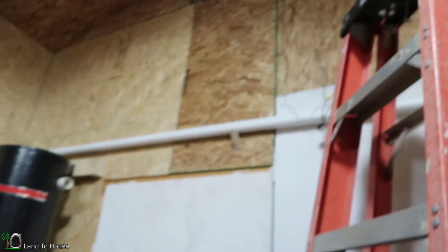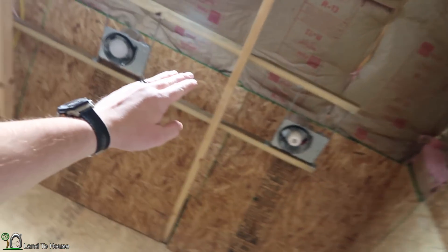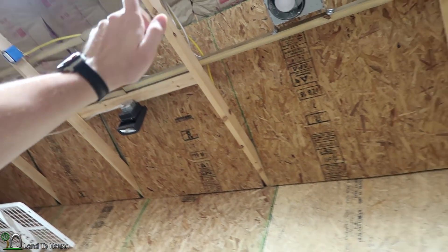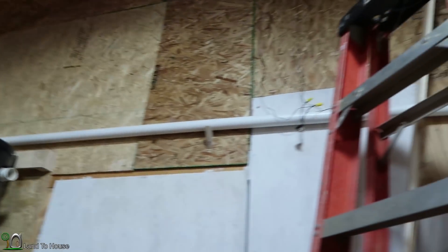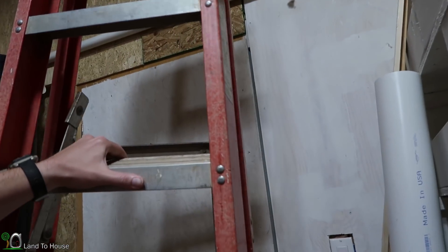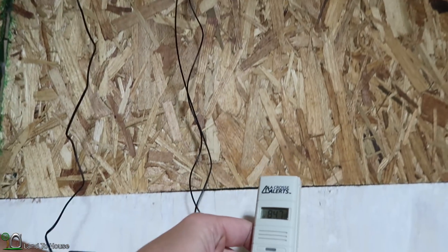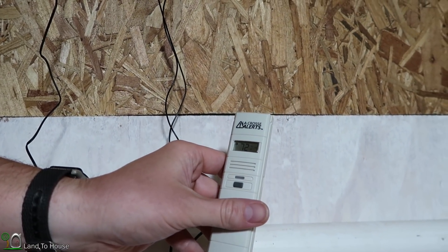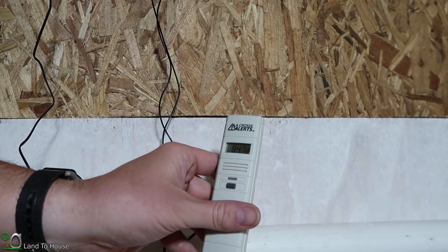After several days of rain we finally have some sun. It's about 75 degrees outside and rather humid, but inside it feels cool and dry. I can hear the fan running up here and I see no condensation building on the insulation — normally by this time with the door closed, there would be. Checking the thermometers: 66°F inside at 72% humidity, and 84°F up in the attic space.